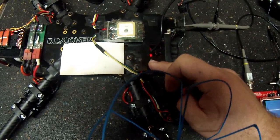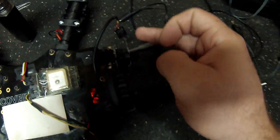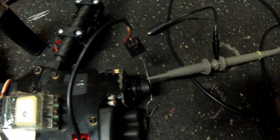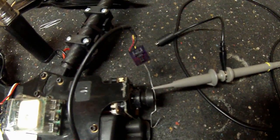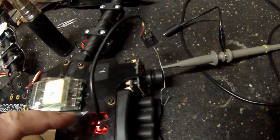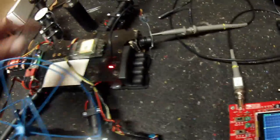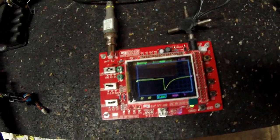The signal path goes from the camera, through a little wire, powered from the Core, into the frame itself and across the board. This is as close to directly off the camera as I can get without tearing it apart. I'm beginning to suspect the TBS Core might not be filtering as well as it could. It worked great on other setups - it may work great on 2.4GHz - but there's clearly noise here.